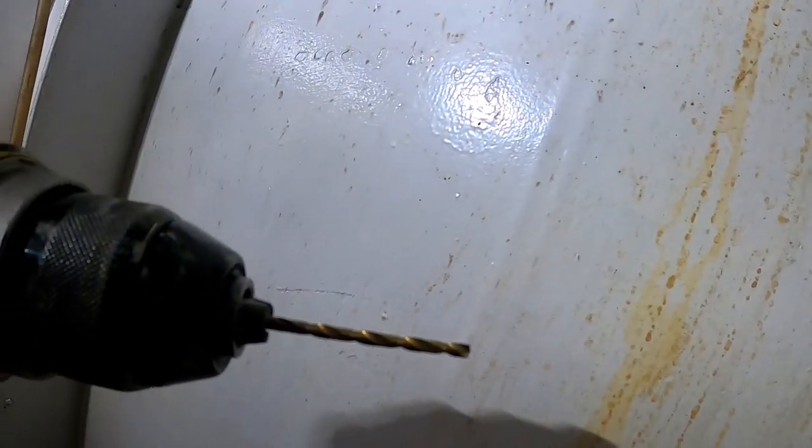I've got a 16th-inch drill bit on here. I'm going to through drill and go check it out on the top deck, to make sure I'm actually in the right place. The advantage of just doing a small hole to start is it's easy to fill. I'm pretty darn confident that I'm in the right place, but I still don't trust myself. If it turns out it's good, then we'll burn the hole in with the plasma cutter. The advantage of a small drill bit is they go through pretty quick.